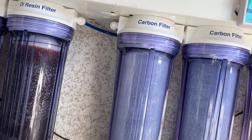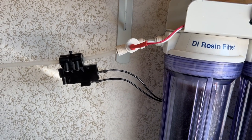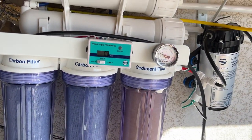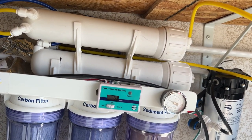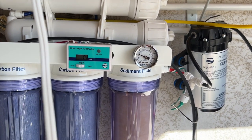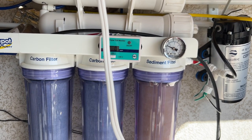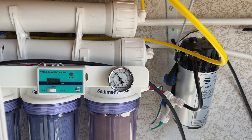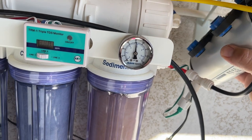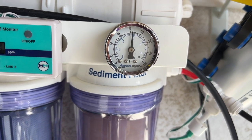Basically I have it all connected, it's flowing now. I have the water source on. When I ordered it, it really didn't have any directions, so I did have to reference online on how to do it. But this is basically a safety valve — as soon as it feels the pressure, it sends a signal to the pump and then it stops pumping. The water will still be there, but as far as the booster pump it'll go ahead and shut it off. I'm going to plug it in and then show you how much pressure this gives. Remember I was at like 40-something PSI — we're going to go ahead and watch it work and kick in.